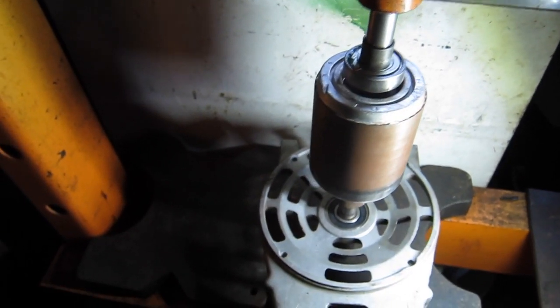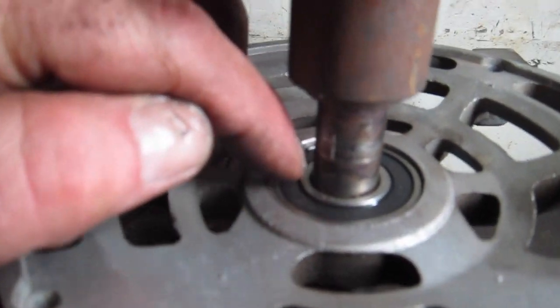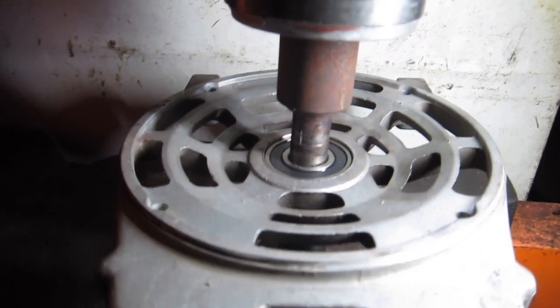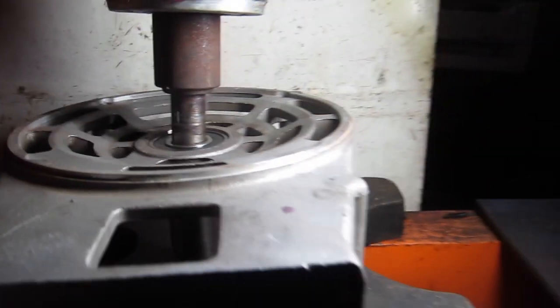And then I'm like, wait a minute, you dummy. You stop pressing, now all the force is going to go on, you're going to side load the hell out of that bearing right there. You can't do that. You're going to destroy the thing. So the bearing's got to be neutral, so equal forces are acting upon it.